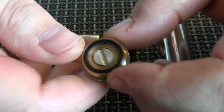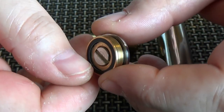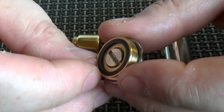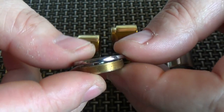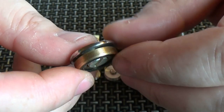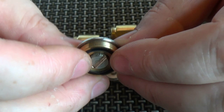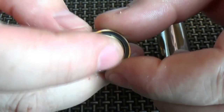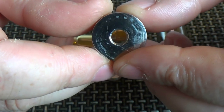And there we go. We'll come back to the throwing the button later, but you can see that there's actually, well, hopefully you can see there are slots down the side there for venting as well, cut down the bottom here, so it will vent through the switch. Should point out that everything in this device is stainless steel or brass. It's going to be 303 grade stainless steel, and like I said, it's rhodium over silver plated contacts, top and the bottom. Now the top cap, we've got a flat top cap here.